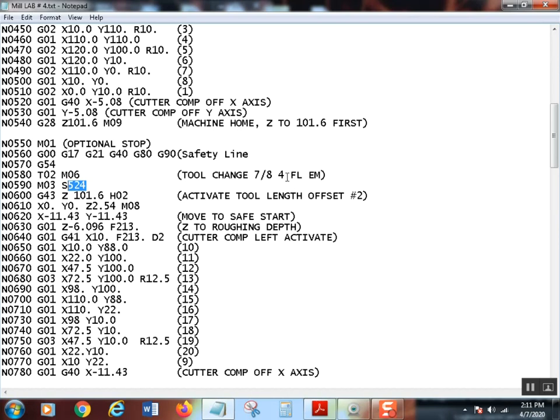I believe I was told, I'd have to go back and look, but once I calculated all the feed, I give you a recommended feed per tooth. I did use 120 as my cutting speed. In the lab, I think it says 325, which is a little too ridiculous. I don't remember why we put it in there like that, but there was a reason we did.